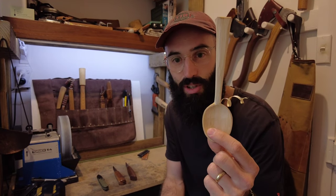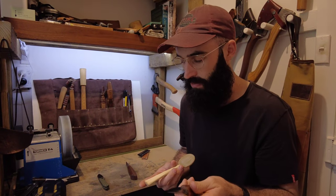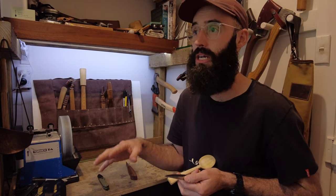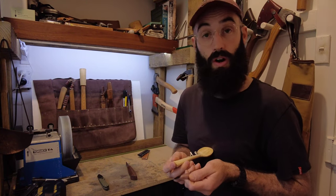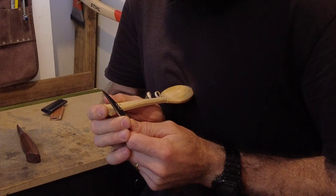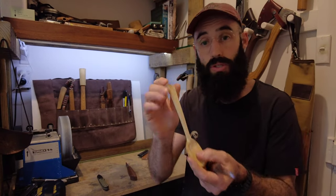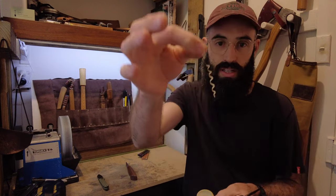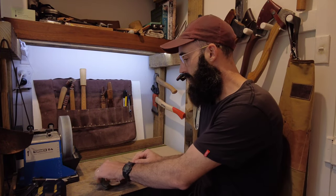Here's a piece I just carved not too long ago and I left it because it looked and felt nice. If I were to carve with my everyday carving knife — and cutting towards yourself is safe as long as you have the right technique: elbows together, knife slightly away from you, very aware of the blade. Carving with a Scandi or a flat over hollow style knife, you'll see there's a lot of control and it wants to exit the grain; it wants to pull away from it, it doesn't want to dive in. That makes it really easy to do these kinds of little curls and finishing cuts.